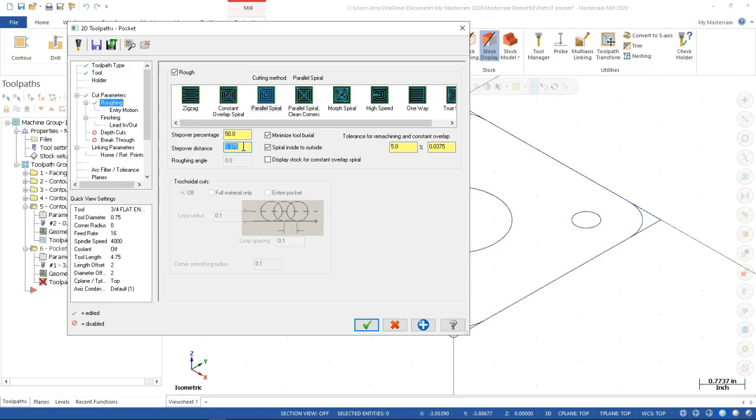So it's always that balancing act of which do you prefer. Are you always machining with the last 1/4 inch of the tool, kind of rubbing that part of the tool, or do we want to use more of the flute length and be a little more consistent? All right, so if I'm going the full 3/4 inch deep, then I'll probably drop this down to maybe 100 thousandths. It's not that much over. We'll see what it does, and it's one we'll need to look at, see where we can pull up the machine times on the setup sheet, or the estimated.